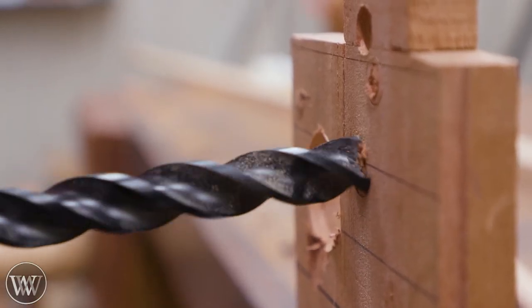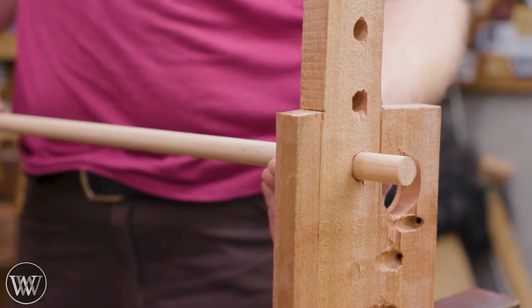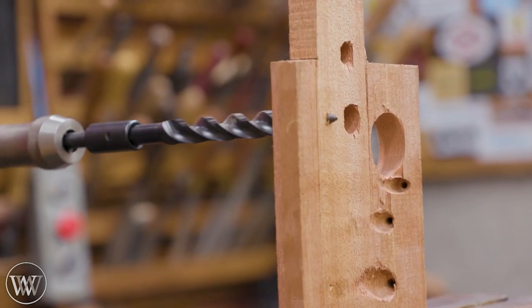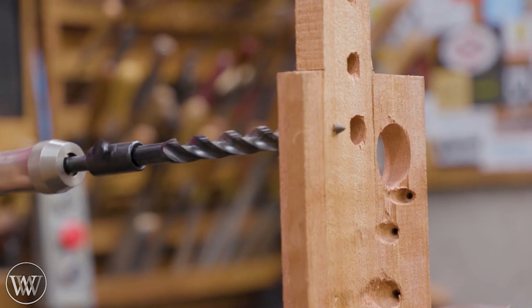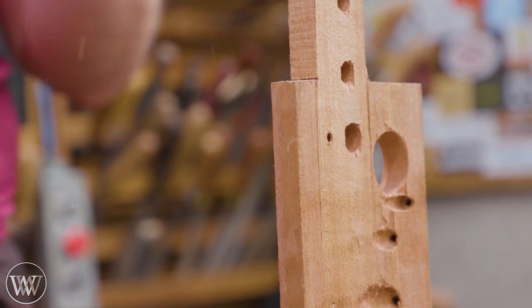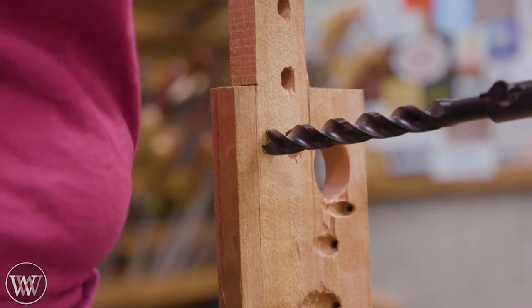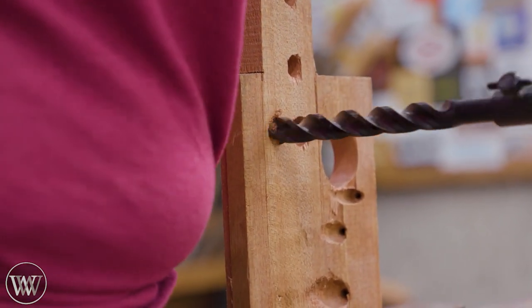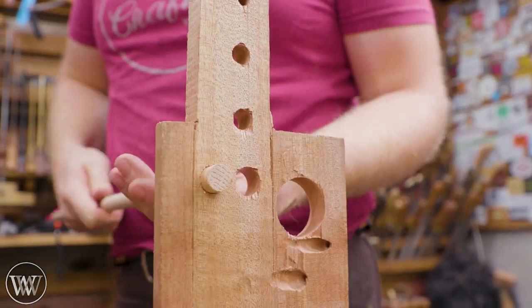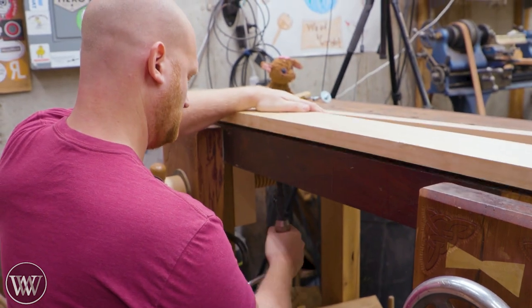Next we need to put a fence on this — one that runs the whole length of the board. I need to make it movable so I can position it up to three-quarter inch from the edge and then slowly move back in three-quarter inch increments. The easiest way is to drill a bunch of holes. I need one set that's a bit loose and one that's really tight.